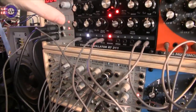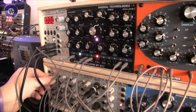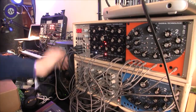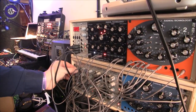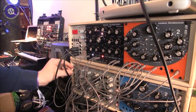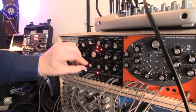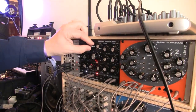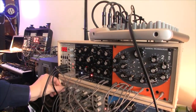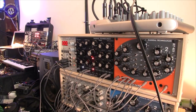So you've also got FM. Is that FM between the two oscillators? It's also for extension — I've connected just the depth oscillator at the moment. It's exponential FM but you can also do linear FM. And this works with all the small oscillators as well, so it's not only with the single oscillators — the swarms are fully working oscillators.